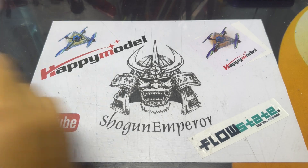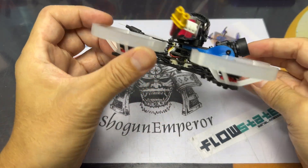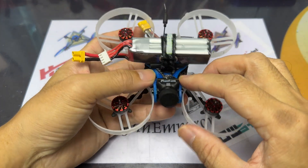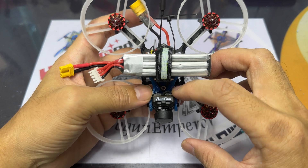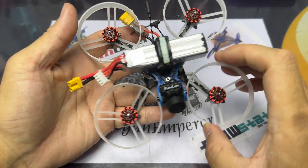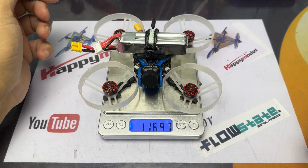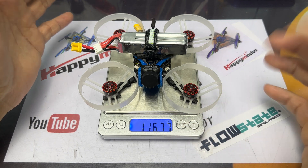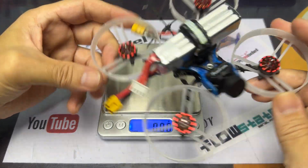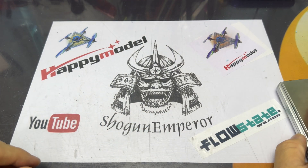It's all done. I've got this 3D printed camera holder that my buddy Sujit printed for me a while back, specially for this project I've been thinking about since December — the parts were printed then, I just never got around to building it. On the scale, the weight comes in at about 116–117 grams, which is slightly heavier and chunkier than the Mobula 8 DJI 03, but this is on 3S with bigger motors. I've done all the setup in Betaflight, unlocked the Runcam Wasp, and it's time to head to the field.